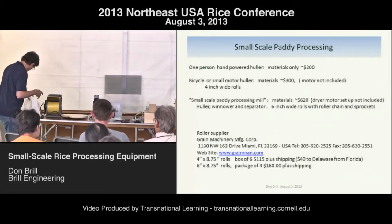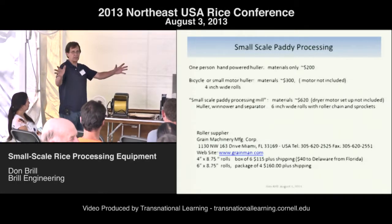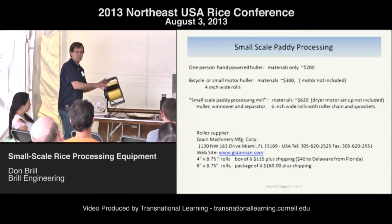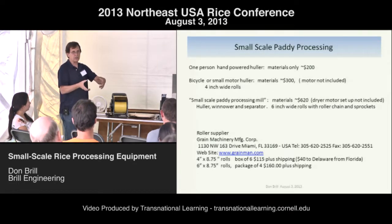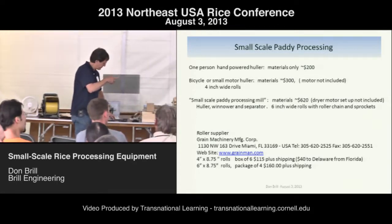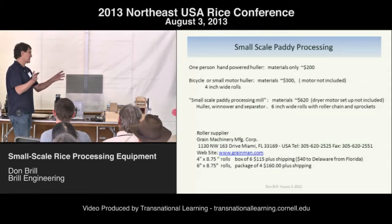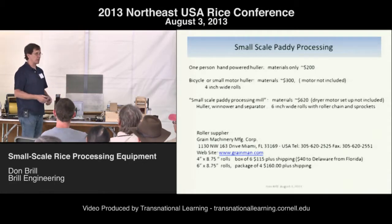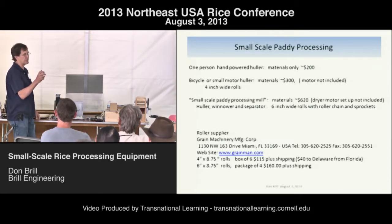When you go to get a fan, a normal fan disperses air broadly. But if you want to winnow and don't want to use what I'm using, these blowers — about $60 to $70, Lasko makes them — give you a real nice directional airflow. We were always blowing and that's a real problem because now you're blowing husk all over, and if you try to do it inside you have husk everywhere. So I woke up one morning and said, well, dryers have cheap motors. I bought a $25 dryer and took it apart.